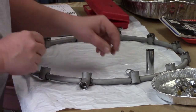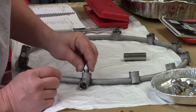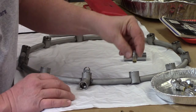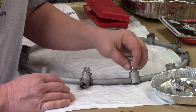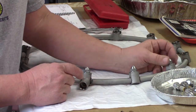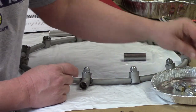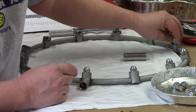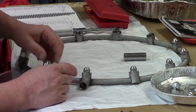All these parts have been meticulously cleaned. We're going to thread all these in by hand — get them started, run them in; they spin in easily. There are no gaskets or seals here, so if anyone wonders if I'm forgetting something — I did double check in the manual and the exploded view parts description — there are no washers. Evidently this is precision enough of a fit that it doesn't leak to any appreciable degree. So we thread all these in finger-tight and then snug them up with the torque wrench.